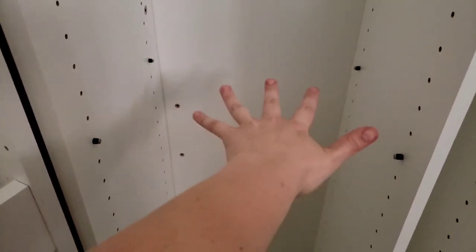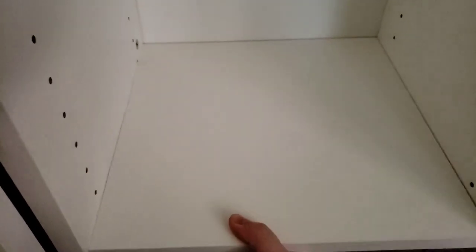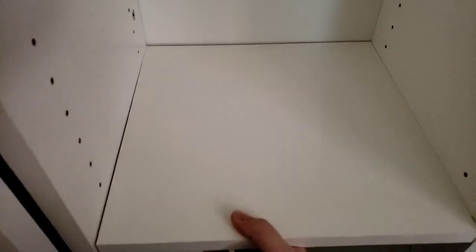It's the same particle board as my IKEA shelves, but it's these proprietary hinges and cam hardware that's making this booger expensive. For structural reasons, this divider shelf is screwed down to hold a bunch more little shelves. This section has a lot of play if you're putting heavy stuff in it. So if you make it rigid right about at this level so it can't wiggle, it won't wiggle up here or down here — that is the structural purpose.